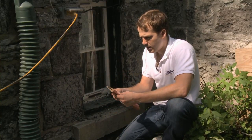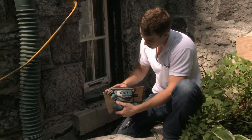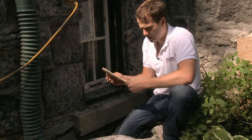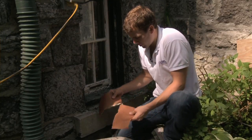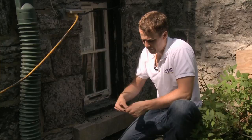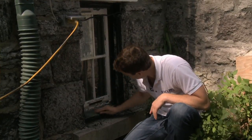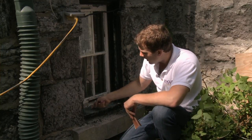There are two different techniques I'll use for sanding. You can sand by hand or with a hand sander. When sanding by hand, it's very important to learn how to do that so you can get into all the nooks and crannies that a hand sander can't quite reach. You're going to fold your piece of paper, rip it, then fold it once like that and once like this, so you have a nice piece of sandpaper. Once you run out of one face you can refold it to the other face and get versatile with it. This helps you get into some of these nooks and crannies. The goal is to sand it down smooth enough that a client couldn't come by with a fingernail and remove any chips.